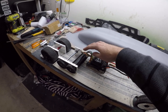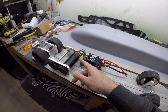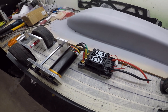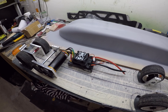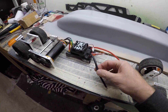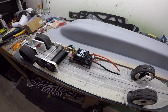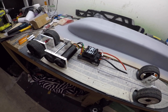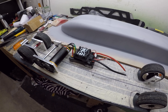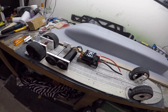As you can see here, the motor wires fit directly into the ESC, and then of course the lipos are going to sit right here. So the goal was that every wire can just be incredibly short. That's going to help reduce any sort of ripple in the system, and it's also going to help with current flow.